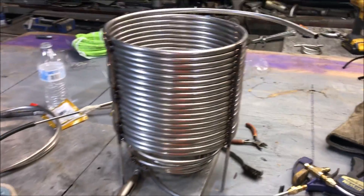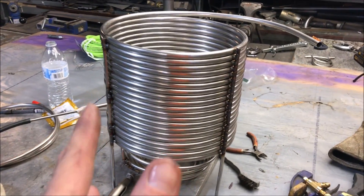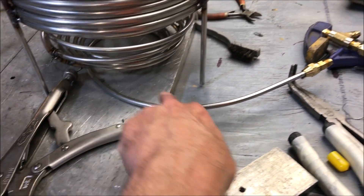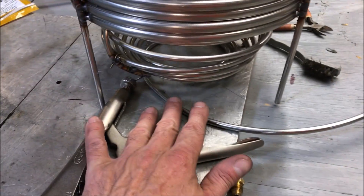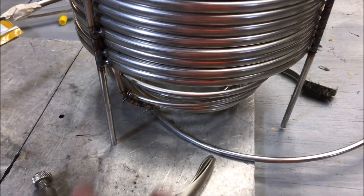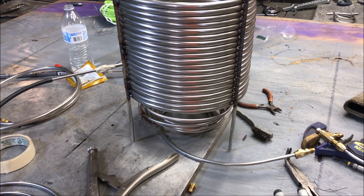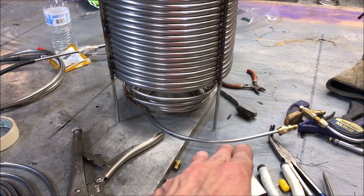In the test we went with a co-flow system, but on the actual unit we're going with counter-flow, which means this will be the discharge line and it will be exposed to the hottest regions of the boiler — which is potentially dangerous but most effective. A lot of things can go wrong with this configuration.